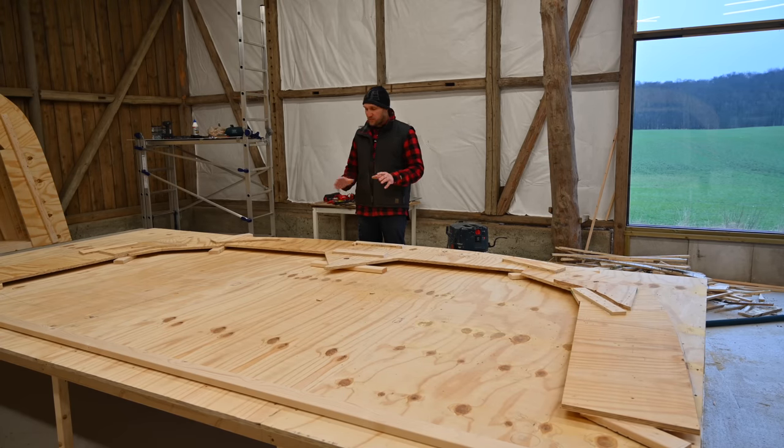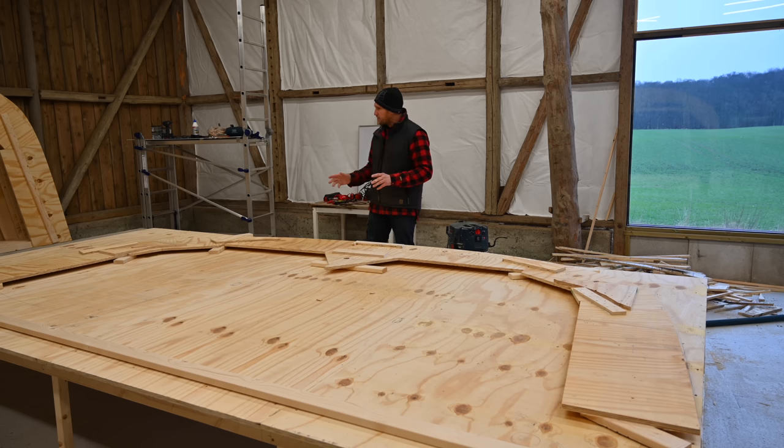I've been trying out the new table now for two temporary molds and I have to say this upgrade has really paid off. The table is a lot more flat and a lot more rigid, and that's a huge benefit when using a tool like the Shaper Origin, because it really needs a flat surface when it does the scan of your workpiece — otherwise it won't come out exactly to the measurements you want. The only downside is that I maybe can't use the thin 12mm plywood beneath the cement now, but that's a small price for the speed I will gain producing the rest of these temporary molds.